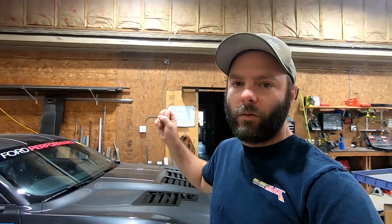Now ABS has a Tg of around 105 Celsius, where PLA I think is like 55, 60 degrees C. So hopefully they'll hold up to the heat at the end of a track day when you put them back in to load your car on and make it home. But since I already have the model, it's pretty easy. We're just going to make a little bit of a tool path and go cut them out.